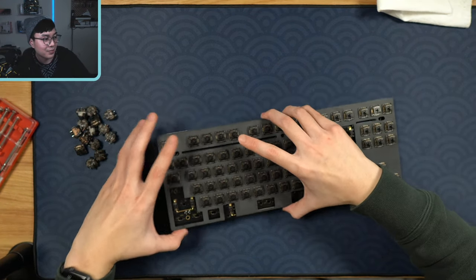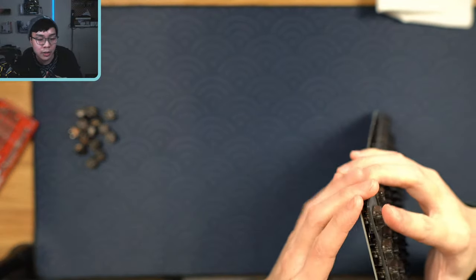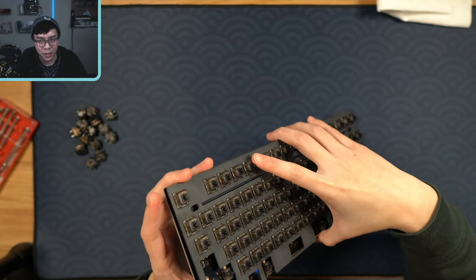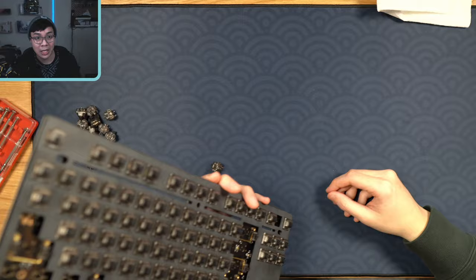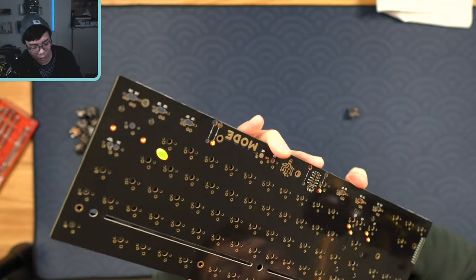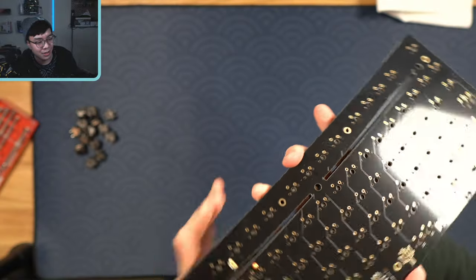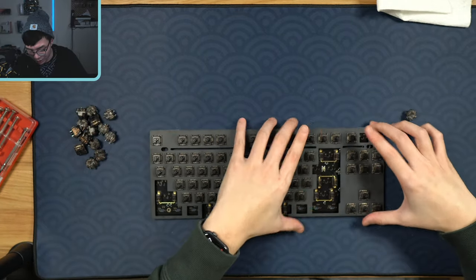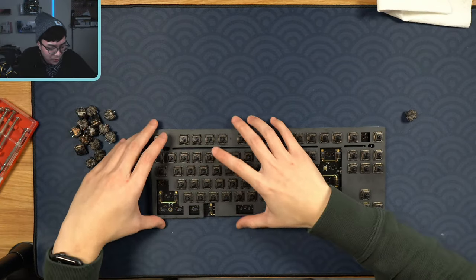Yeah. Nice. I do use a power supply with my soldering iron. So the TS-100, I bought a bundle, and it came with a bunch of junk, honestly, but it did come with a short power brick. I don't use that because I have an old laptop power brick that I use to power the soldering iron now. So if you have an old laptop power supply, you can just use that, as long as the connectors are the same.